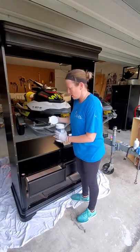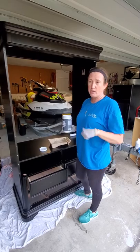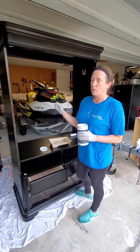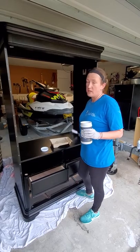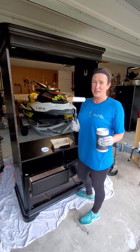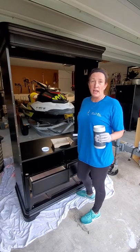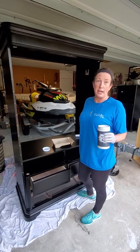So what I do with this is I'm going to pour it in a paint can. Typically, with the paints that I've used before, I'll stipple it with a brush first and then roll over it with the roller, but this time I'm going to use this for the primer just because it's a large surface and this covers a little bit easier. But once I start painting, I will use the stipple brush for the first coat and then the roller for the second coat.